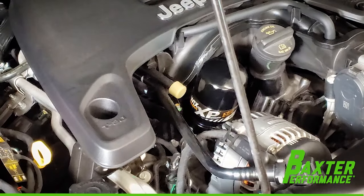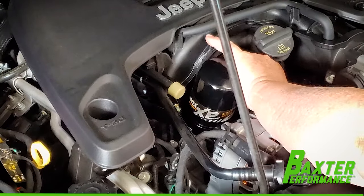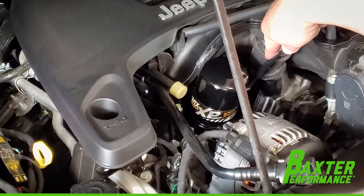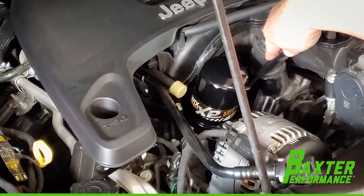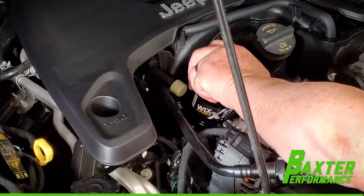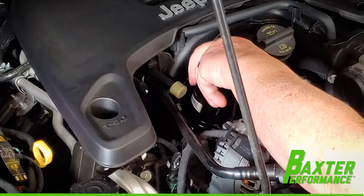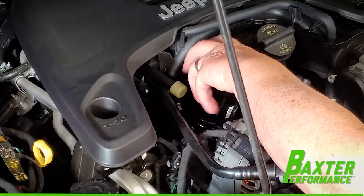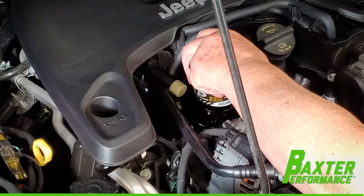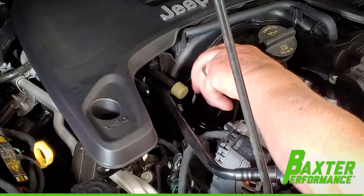Now when you're ready for an oil change, you can simply remove the cap from the air valve. With compressed air, simply hold it down for three to four seconds, and that'll blow down the system adequately to be able to remove your spin-on filter. As you can see, no oil spills out, which makes for a very clean filter change. As you had before, but now we have the advantage that we're keeping oil in the upper system and not having to make up for it with every start.